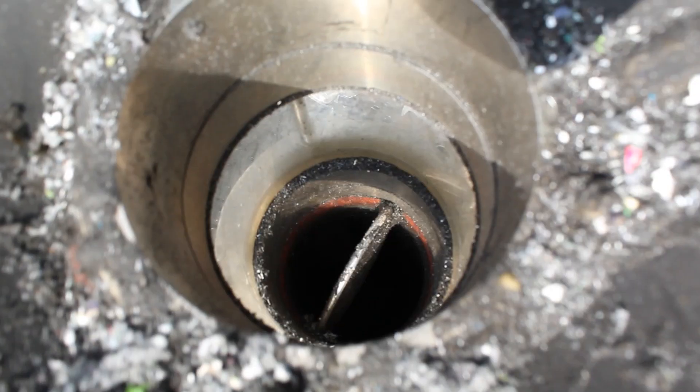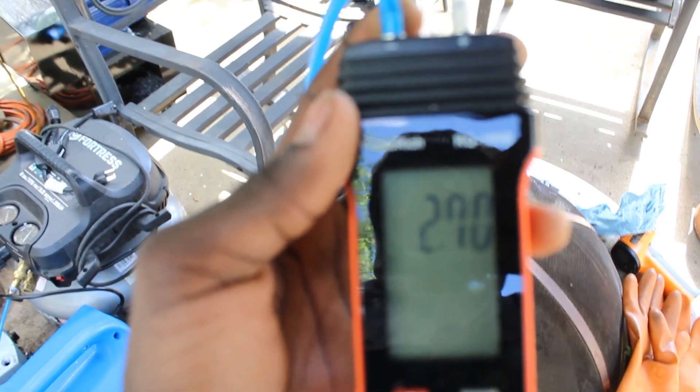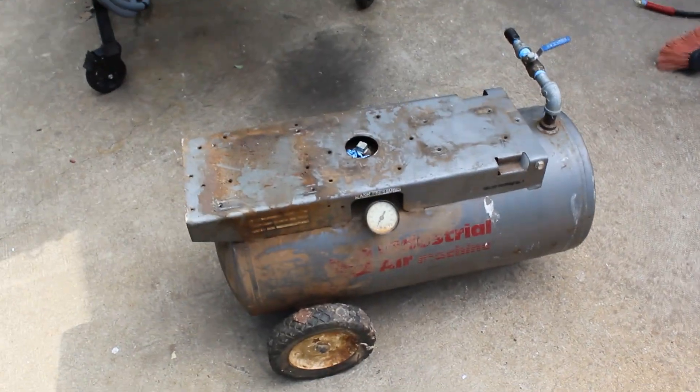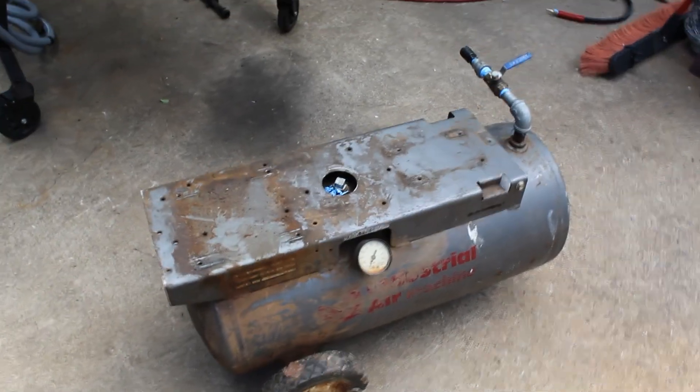To get this machine ready to run, we've got to pull a vacuum — we've got to close all the ports. Gotta love the wireless remotes. Let's open up our vacuum ports. This right here is a manometer — this will let me know the actual vacuum level in inches of mercury. Right now we just started, we're at four inches of mercury. I like to do about 25 inches of mercury. I also have a new tank to put the natural gas into — bigger than the propane tanks, we can go up to 300 PSI. I checked it, it's good, it's safe.